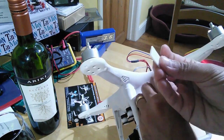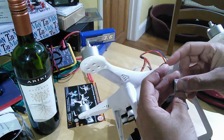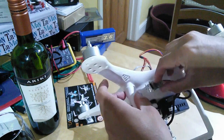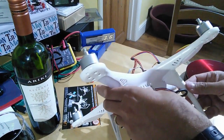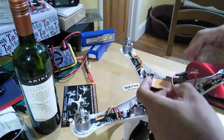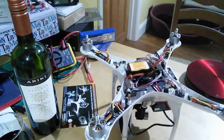I'm going to put that there - I know it's meant to be a cooling vent but it's not going to block the holes because I'm using a generic sticky pad. I'm not even going to trim this pad because as it says, as long as I leave that barometer hole clear, that's all it requires. Let's peel off the other side and press fit that. I'll keep some room for the ventilation and just press that in. Good, just double-check I haven't done anything stupid. I can remove the SD card - micro SD - and that's it.